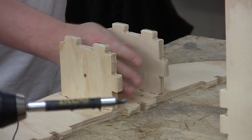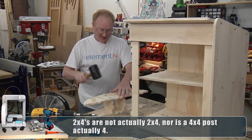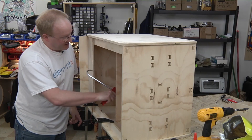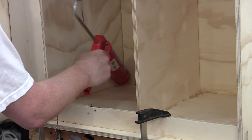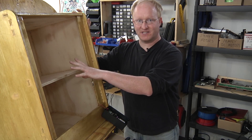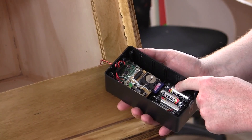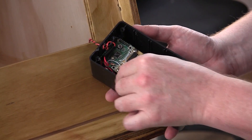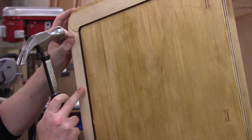This is the bottom piece. The 4x4 post — actually 3.5x3.5 — will fit in here, and this will fit snugly around it, hopefully not too snugly. There are bolt holes to further secure it to the post. I'm going to caulk the inside to keep water from getting in and gluing all the boards together. It went together pretty tightly so I don't think I need that many screws. Felix and I put shingles on the case and then polyurethaned everything. This is the project box we're going to use — we have industrial Velcro on the back, batteries powering everything, a battery powering the real-time clock, a master power switch, and then the secondary switch controlled by the door. When the door closes it turns off.